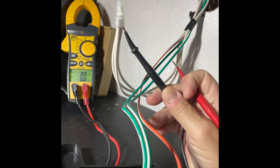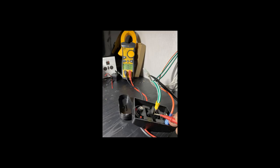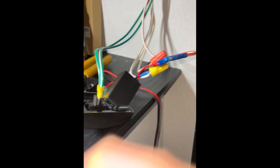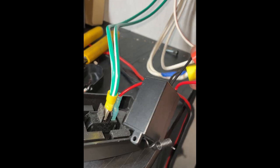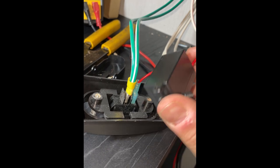So we're going to try to change those fasteners and shorten that up. Right here you need to be careful and identify what wires are what. Make sure the positives only go on the positive and the negatives go on the negatives. There are line and load terminals that are clearly marked. I need to make this wire just a little bit longer, but I've got the common tied to the relay side of the switch and the hot tied to the proper side of the switch.